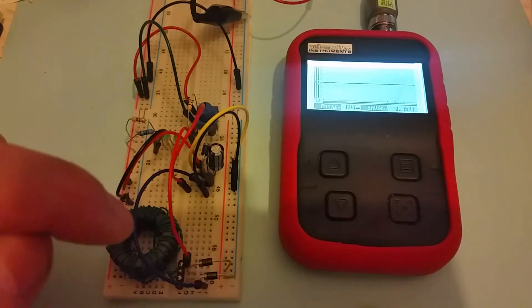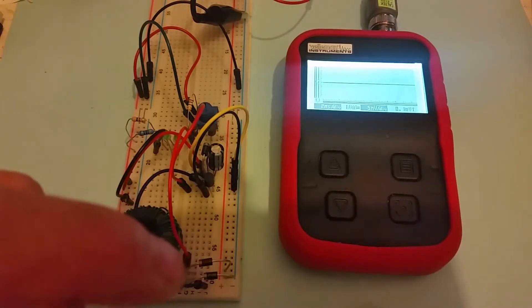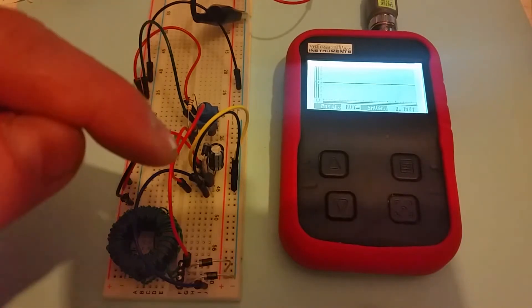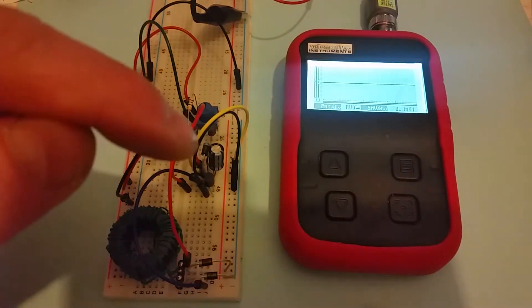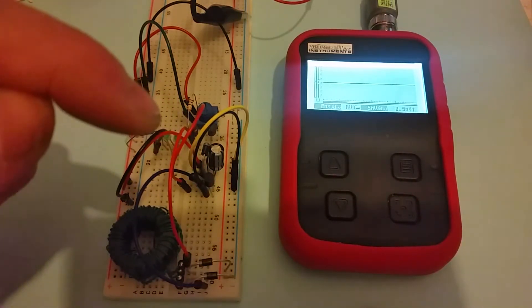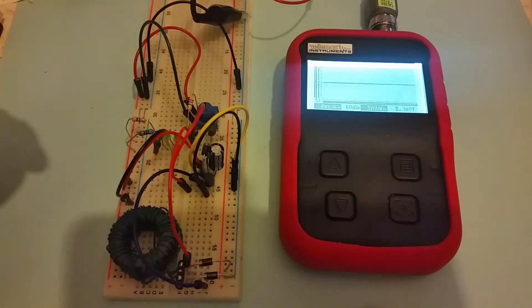magnetically through magnetic flux rather than electrically as well - because the current can't go back up through the diodes. The transistor is basically the same. I've still got a diode, which I've changed to a germanium diode now rather than a signal diode for a bit more efficiency, and I've got a capacitor which does the smoothing of the signal so it still goes to a DC current.